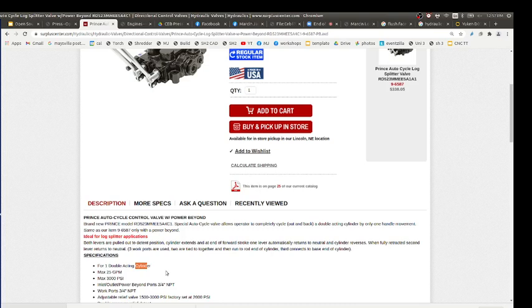That's the main distinction we pay attention to: get cylinder valves for cylinders, get motor valves for spinning motors, typically. So on the tractor, for instance, going from moving forward to going into reverse, there's no real time delay that you have to worry about. The valve just has to be able to handle the pressure. But going from forward to backward, the inertia change in a 180 degree change is huge, it's a big spike. So you can't do that without going through a pressure relief valve. Yes, Bobcats can go forward and immediately backward, but there's a little slowdown and then you go back. It's not instant. It'll beat you around quite heavy, with very large forces on the components.